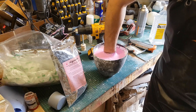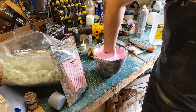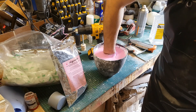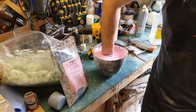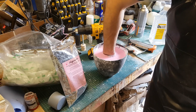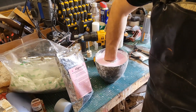Now it's really just a case of waiting for the alginate to set. As it does set you feel it becoming a bit firmer around your hand, and you get a bit of a suction effect — a sort of vacuum between the mould and your hand. Once it's set, I need to slowly work my hand free. I'll speed up the video slightly to get to the point where it's actually set. At this point it was feeling quite firm, and as you can see I can pick the whole thing up without it falling apart, so it looks pretty much set.